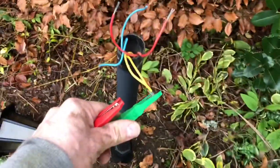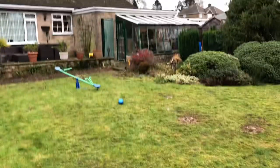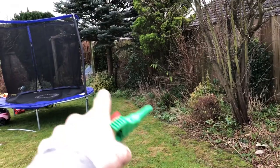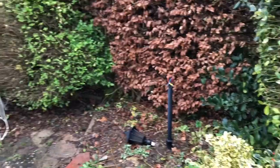I haven't tested that one yet but I think it will be okay. We've had to disconnect every single light — I'll just go on to it and test it and as you can see, 999 megohms. Basically what we've done: we started off over in the far corner, then gone to this one, back to this one, all the way through and now we're on this one here. There are another three or four lights that are faulty still, but these ones here are good — no poor readings — so I'm going to concentrate on getting these ones reconnected.